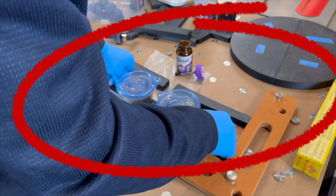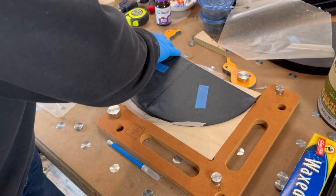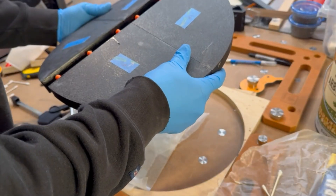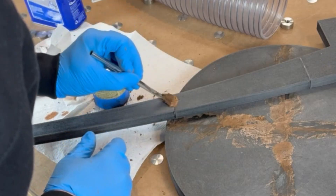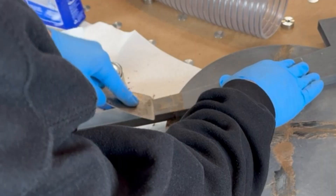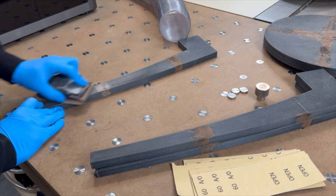I made this custom work table using a special drilling jig that I had bought. Next, I assembled the tabletop, first gluing two quadrants together to form two half diameters, then I cut these forms on the bandsaw to help in gluing the two half diameters to form the full tabletop. Then I used wood filler to fill the seams on the legs and the tabletop because I didn't want the seams to show through when I attached the walnut veneer.